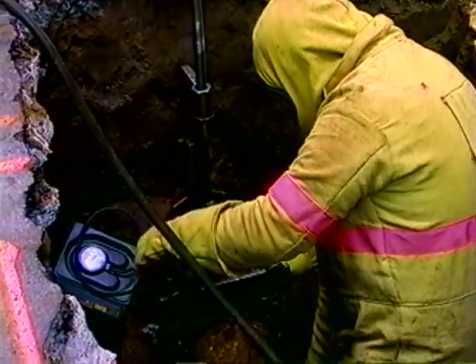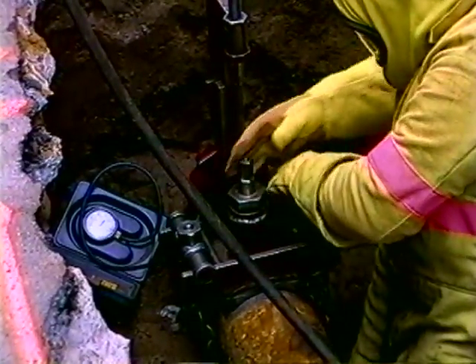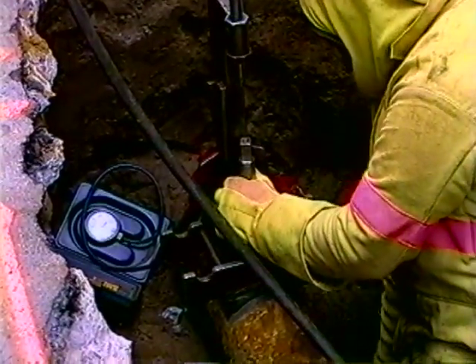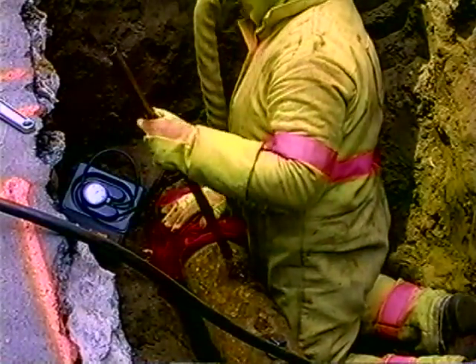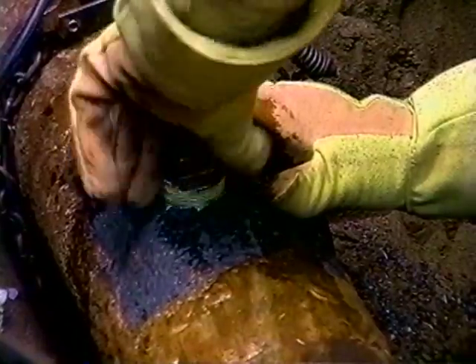With his flash suit on, he's going to lift up the bit out of our tap hole, making sure we don't damage the threads. Always back the bit out by hand. The officer and other employees are going to control the pedestrians and traffic. Keeping your wet rag ready, loosen up the chains, and while holding up the bit, slide the machine. On a steel main, carefully stick your finger in the hole and clean off the burrs — be careful not to cut your finger. Now we clean the shavings out with the copper tube to ensure there won't be a spark. You must clean out the bottom thoroughly or the bag won't make a tight fit and gas will seep through. Plug this hole and repeat this procedure for additional bag holes as needed.